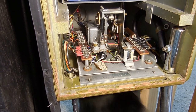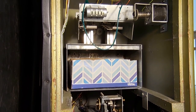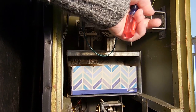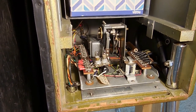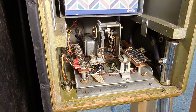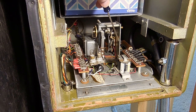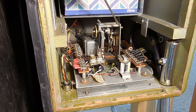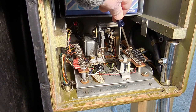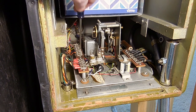This is the interior of the gun stand. Up at the top we have the two coin slides and a coin counter. This is a shot sounder — it makes the big bang sound when the gun fires. In the bottom is the typical mechanism that Seeburg developed for a lot of their jukeboxes. It allows you to put in 25-cent pieces and dimes and have different numbers of plays. This whole motor, the gear drive, and the contacts over here keep count of how much money has been put in and therefore how many games need to be played. There are a lot of terminals here with wires coming and going. These wires are coming from the amplifier, these wires are controlling this box, and these wires are going to the gun.